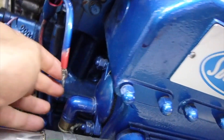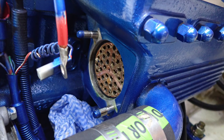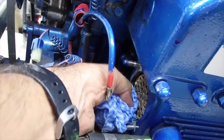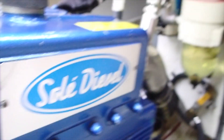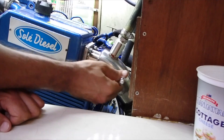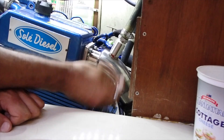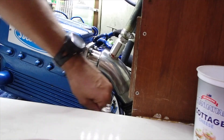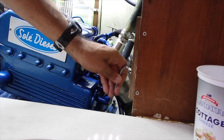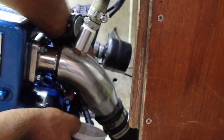There's a little bit of water draining out of there — some salt water. I'm trying to catch that with a rag. There's no full blockage but there's definitely some scale build-up. Now I'm going to take the back inspection cover off and have a look at that one too. I'm noticing these aren't overly tight — they have a spring washer and an o-ring setup — which makes me think I shouldn't over-tighten these when I replace them, or we could end up with too much compression of the o-ring.